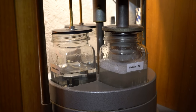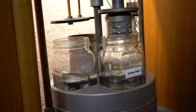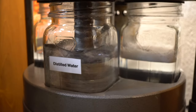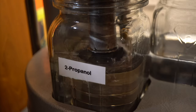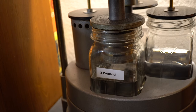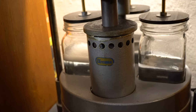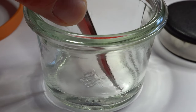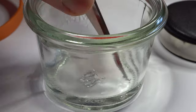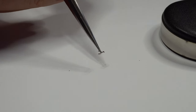The Super Automat is fully automatic and goes through three stages of cleaning. First, a wash cleaning solution called Platina, mixed 1 to 20 with water. Then it goes into distilled water for the first rinsing, changing directions as well, cleaning off the parts. After that, we get rid of the water using isopropanol alcohol, drying them up and then going into the heating. The pallet fork is not going to the watch cleaning machine because the pallet jewels are attached with shellac and isopropanol would dissolve it — so we have a specialized solution for that.